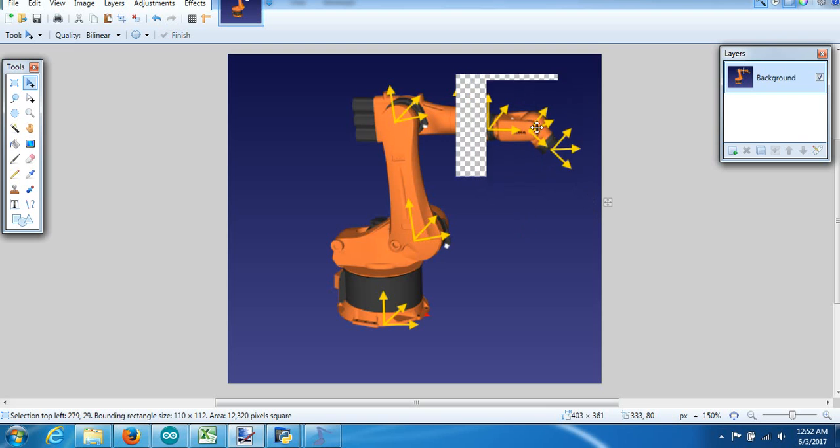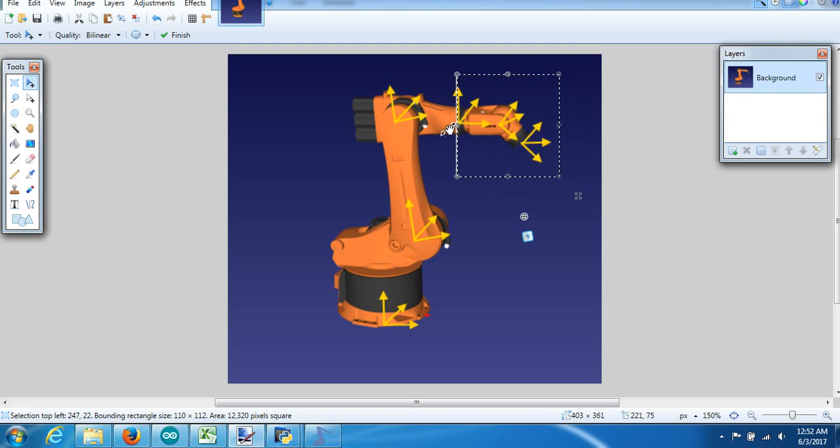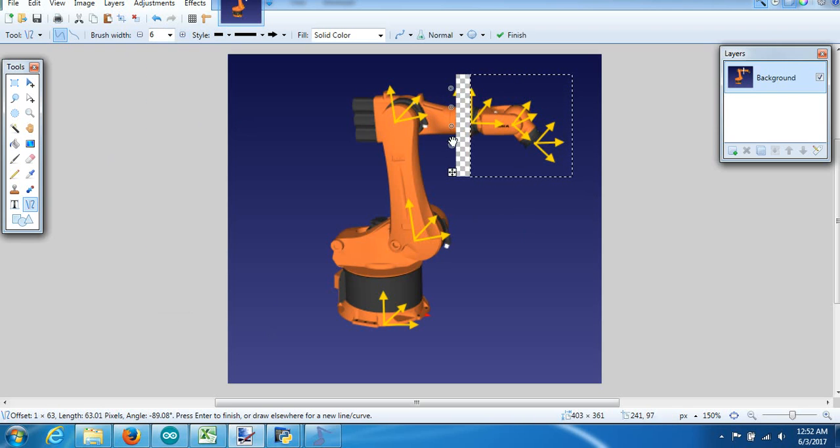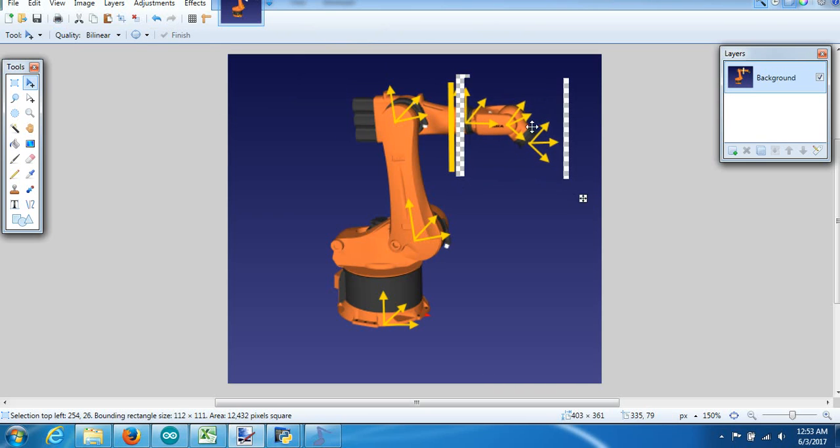When we slap the wrist back onto J3, this frame actually has to be inverted. Think of it as — this yellow line is kind of the face of the frame — we have to stick that wrist to it. Depending on where it's pointed, what angle it's at, we have to invert it. We have to invert this frame so that it's correct, otherwise it'll be reversed.